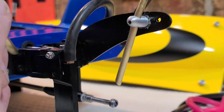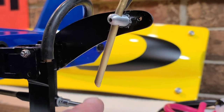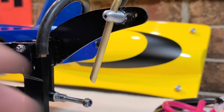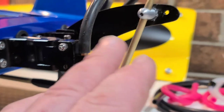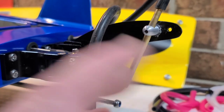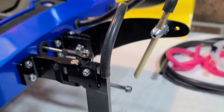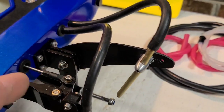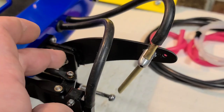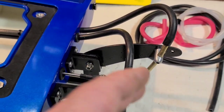She's almost balanced — that should cool our temperatures down. I also decided to run the straight tube to the blast pickup instead of the curved tube. With the straight tube I should be able to get it just behind the tip of the propeller blades. I also moved it to the other side of the strut bracket. The blast pickup might be hit or miss — I definitely want to get a dual pickup rudder. The nice thing is I didn't have to drill any holes in the boat; I just used the existing bolt to bolt it all up.